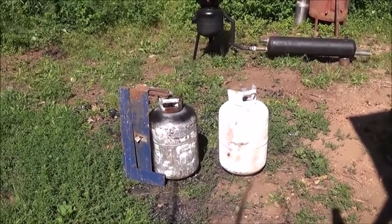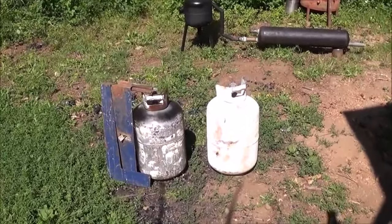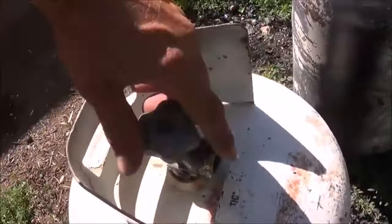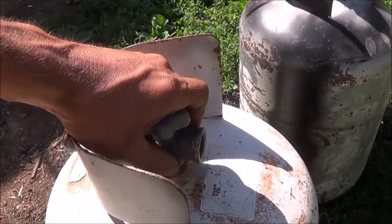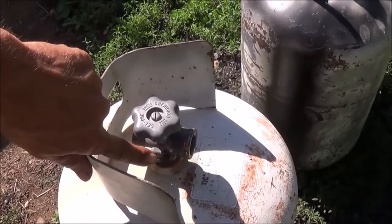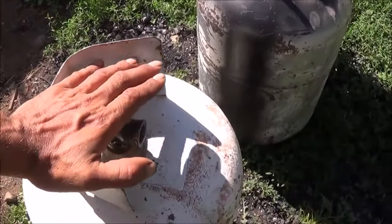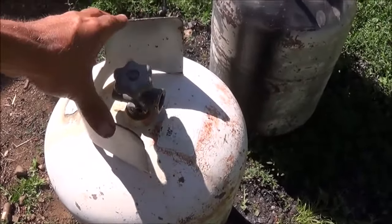Even then, they're not safe to directly cut into. What I do is fill them all the way full of water right into the opening of the valve. I stick a tube down into the opening, and because the bleed-off valve is removed, you can just pump water in. When it gets to the top, the water will come out the bleed-off valve letting you know it's full. I keep water in it the entire time I'm cutting until I've removed the larger section.